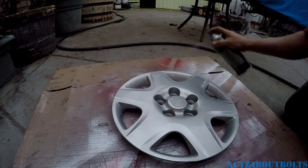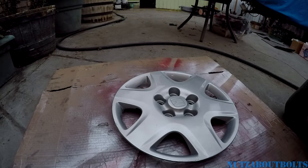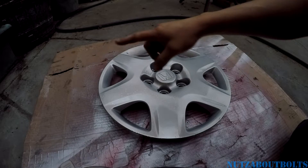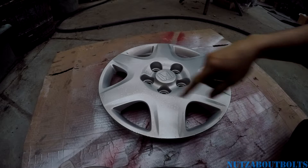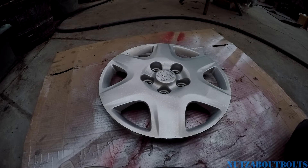I went ahead and did the clear coat, and this is a good example of why you need to follow the directions. It says to reapply additional coats within 10 minutes — including the clear coat — and now I've got all this weird blotchiness. Just remember to be patient, because sometimes when it dries these things fade away. Make sure you follow the directions and watch the clock.